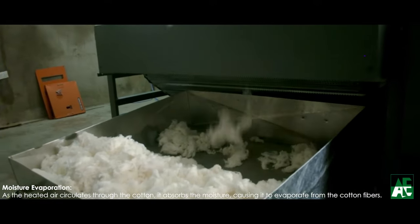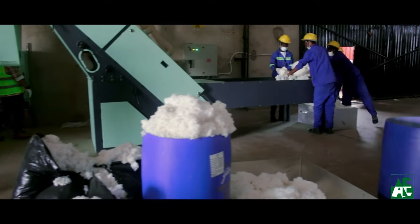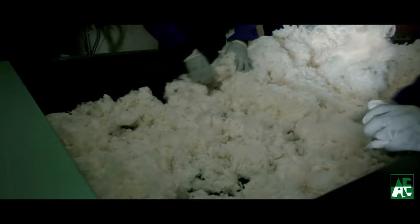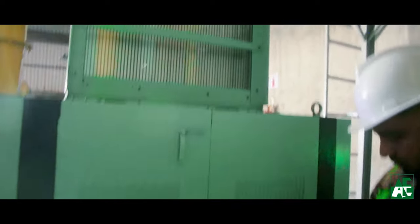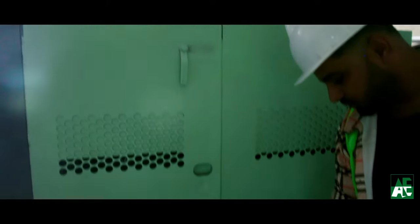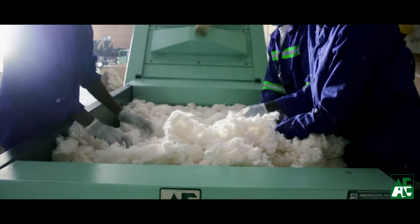The collected dry cotton is baled by the bale press and is ready to sell on the market. Meanwhile, the dry cotton is also ready to process in the surgical cotton roll-making plant. The roll-making plant consists of a six-beater machine which helps to open the fibers, liberate micro-dust and small dust particles, and reduces the tuft size of the cotton to make the process more comfortable. The waste control bar in the six-beater machine helps to have control over the waste.